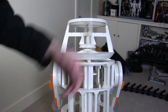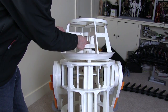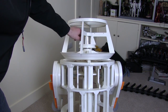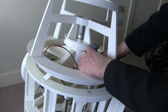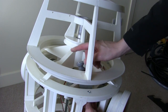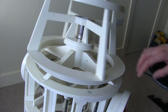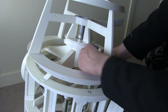Here it is — I've bolted the ring onto the body and it looks pretty good. The aluminium pole stays stationary and it's a tube, which means I can run wires up it and put a slip ring on the top so I can get power and data into the head through that rotating piece. My motor is intended to fit in here with a bracket which is currently printing, then I'll put a drive belt on to drive this. The other option was to sink the motor down in the body with a big rubber wheel, but that would need a sprung mechanism to ensure it always grips — that's not something I'm up for building right now. So I'm going to 3D print a NinjaFlex drive belt that's exactly the right size and then power it up and see how fast it goes.